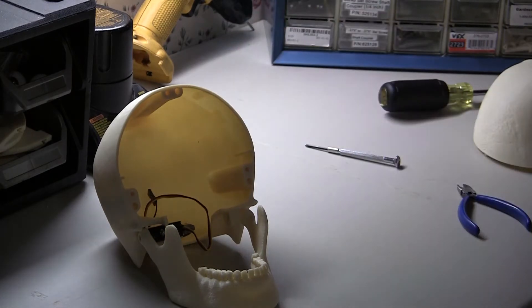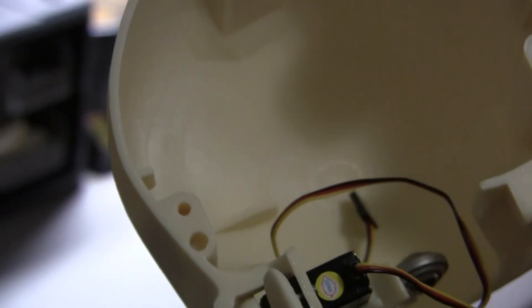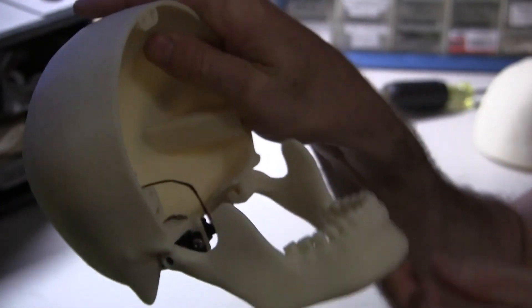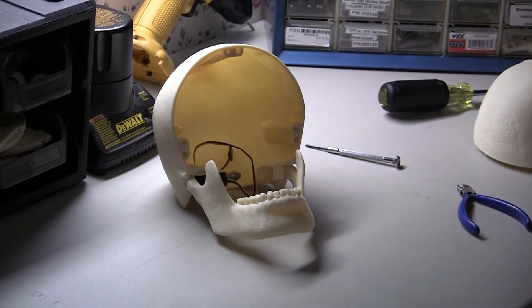At the end of step two, it should look like this. You've got your servo in there, and you've got your rod end in there from step one. You've got your servo screwed in with that screw in the front, and you've got your jaw screwed to the servo with the gear in between. That keeps it so the jaw can move the way it needs to without ever stripping the gear. That's complete step two. Thank you, and I apologize for the noise in the video — it's a hot day, I've got my air conditioner running.